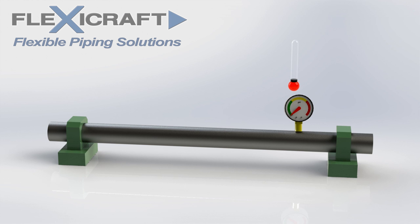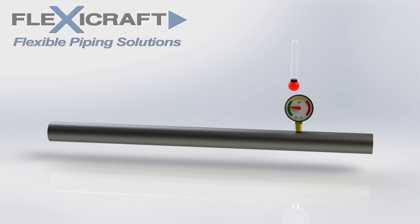We can now go back to our pipe system model, at first without the anchors. This time, we pressurize the pipe instead of heating it up. The pipe acts as though it's plugged, with the thrust load acting on both ends because of elbows and other ends down the line. Notice there is no movement of the pipe because the pipe wall is too stiff to be moved by the thrust load.